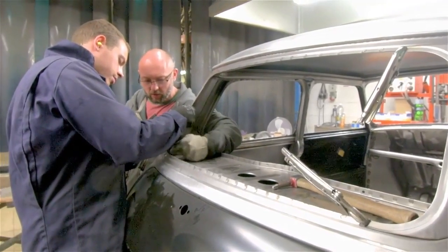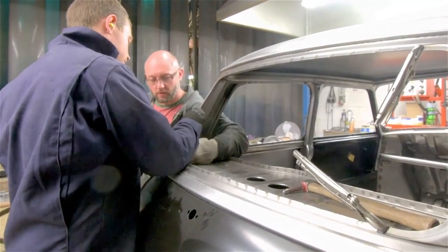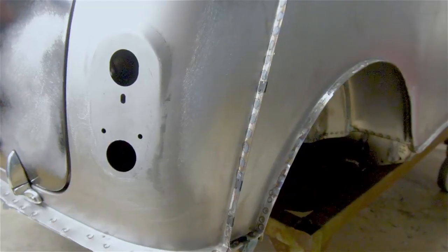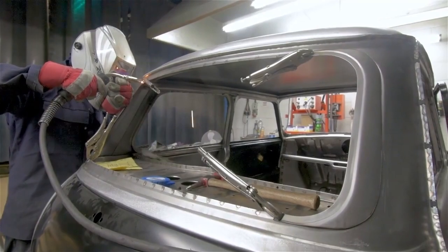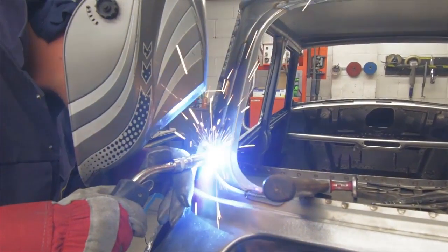Early Minis had a narrower rear window. Press tooling for this significant aspect no longer exists. We were able to modify the process of the later panels so that the early taillight configuration could be retained, but in the finishing of our Mark 1 shell, infills have to be added to reduce the rear window aperture.